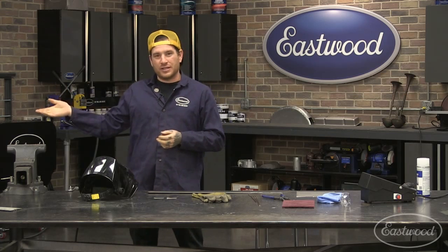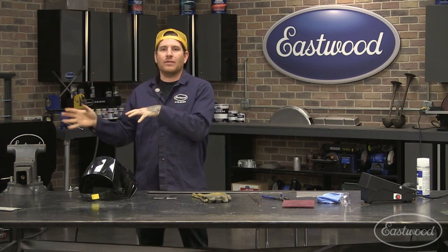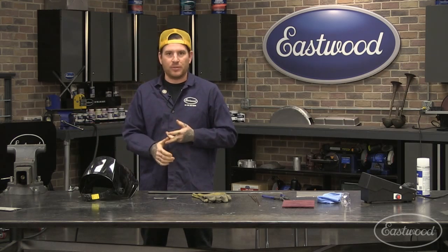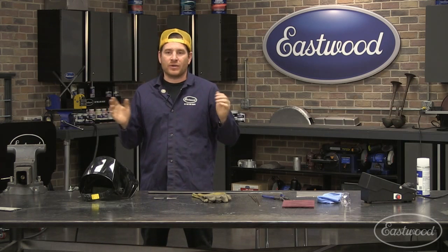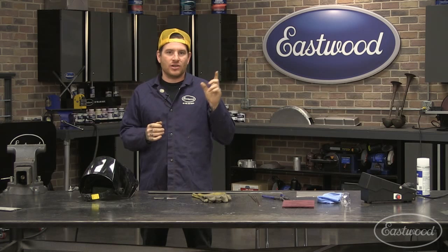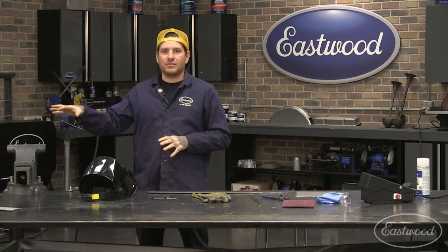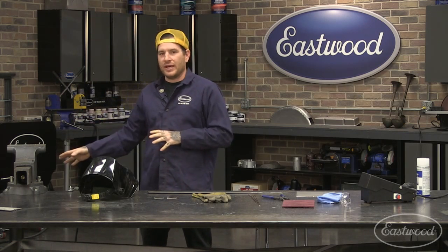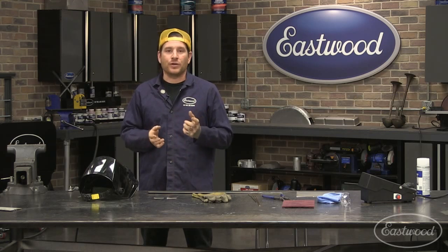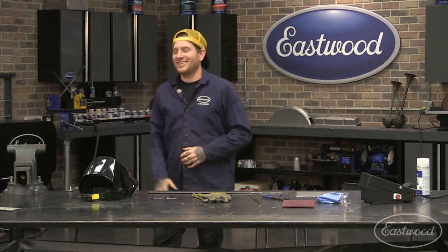Now on the TIG 200 digital, I only use the finger switch, but that's because the machine has a lot more controls that you can preset, and you can actually set it to have a pulse, a ramp up amperage and a ramp down. So I can actually control how it acts, and it also has a multi-process with the finger switch. There's a lot more learning curve to learn how to set the machine up, but with the analog machine you can use the finger switch and definitely get a lot of welding done on the vehicle. So that's where I use those. Long explanation, but that's it.